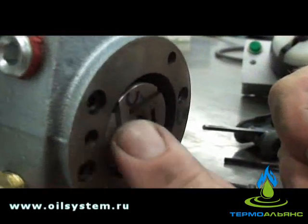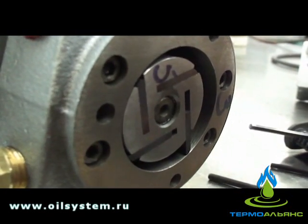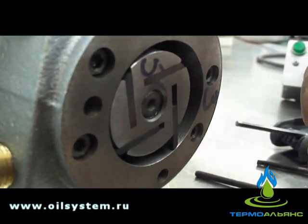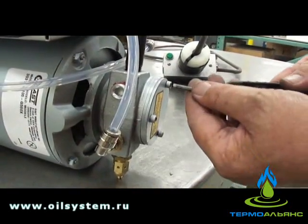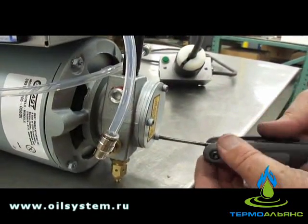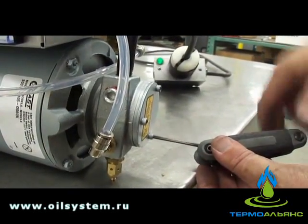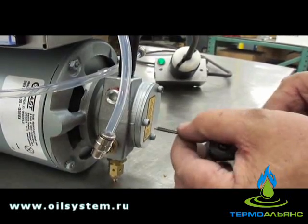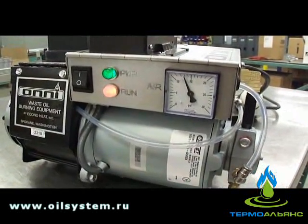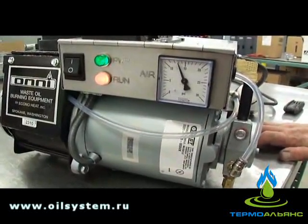You want to make sure this hub is flush with the housing. If it's starting to slip off, that could be what's causing the grooving. So if that hub is starting to slip off, then we need to investigate further. Once the inspection or vane repair is complete, reinstall the end cap on the compressor — just snug that cap, just enough. Make sure you turn the burner back on. The compressor will automatically kick on, and as you can see, we've got 12 pounds of air. Everything worked out on this job.